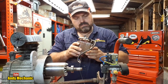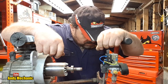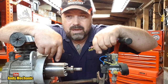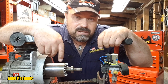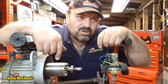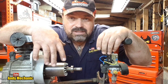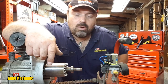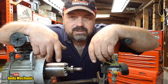What a shame. Now, I suppose somebody out there will be able to fix this and repair that bit of winding. Over here in New Zealand, you can pick up these little tiny air compressors secondhand for around 50 New Zealand dollars, which is just nothing. This one in England, I think, cost us about £150 brand new. It did 15 years. So it has two faults. It would need a new capacitor and a repair, or a rewind on the field winding. And it's just not worth doing. These things are a disposable unit.